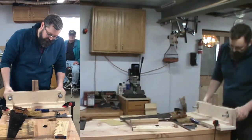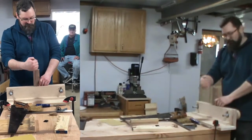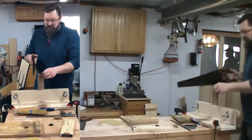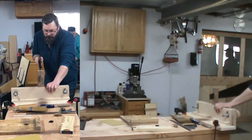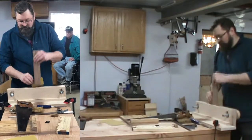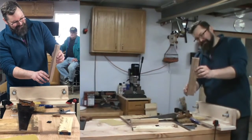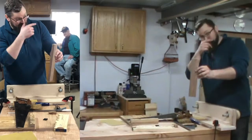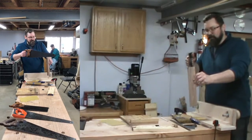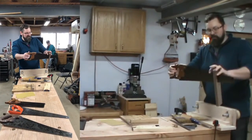You just continue that all the way down — which is why if I have to rip boards, I would much rather use a band saw, table saw, or something mechanical. Ripping means cutting in the direction of the grain. If you look at this board, I intentionally went a little off vertical on purpose. Because once you start down that saw, it will just follow that line — they're called smart tools for that reason. Once the panel saw is in, there's really no way to turn it because the plate is too big.